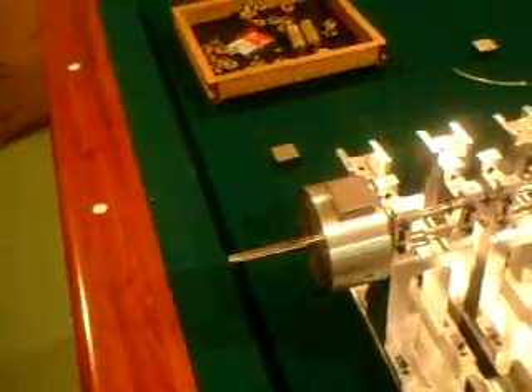What I had was cold roll steel and it was kind of sloppy — it was like a thousandth and a half on the bearings, just a little too sloppy. So I ordered some special steel and then polished it down to fit in here. I accidentally bent this end on it, but I'll straighten that out — I'll put it in the lathe. That's no problem.